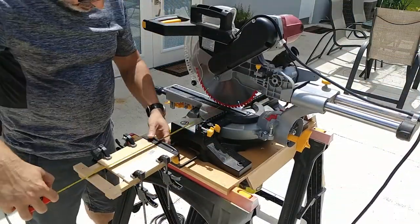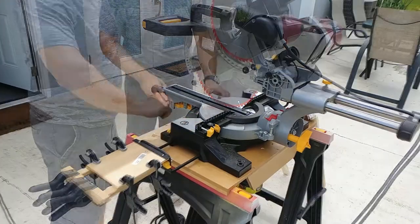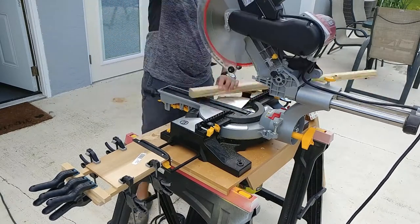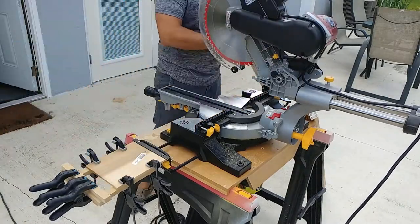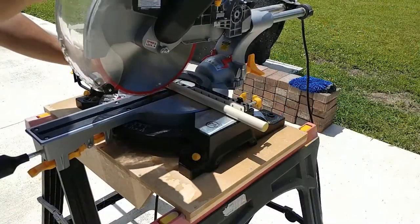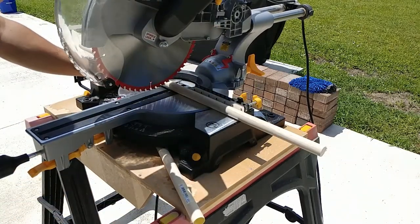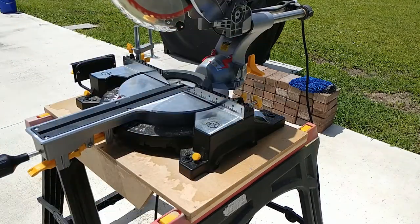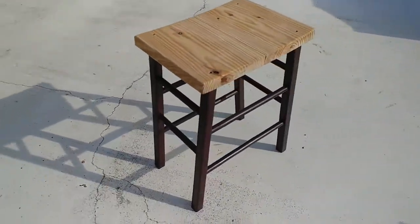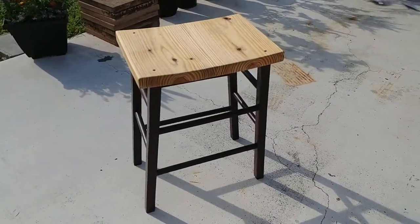I started the process by setting up a fence that would allow me to cut four pieces at 24 inches in length. Those were done with a miter saw set at 5 degrees. In hindsight, I should have used a circular saw or miter box — after all, my channel is all about building stuff cheap and with basic tools. I then proceeded to cut two stretchers, the horizontal pieces between the legs. Then my wife walked by and said it would be nice if we had more of those so we could use it as a step. I ended up adding two to each side. This is a huge variation from the inspiration piece, but it doesn't look bad and it adds extra functionality.